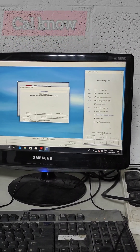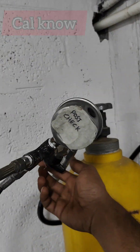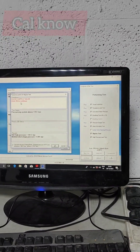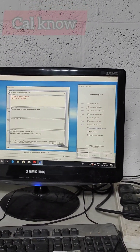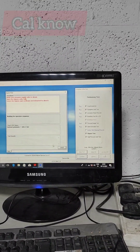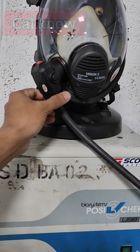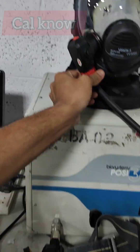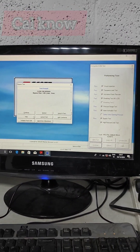Now we go for the bypass test. Make sure the regulator is connected to the face piece. We open the pressure supply valve for the bypass test, then close the valve again and press OK to continue. We open the bypass valve fully until instructed to close. You can see the initial pressure and current pressure dropping. Just passed — we close the bypass valve. The flow is 89.89 liters per minute, so it's passed.